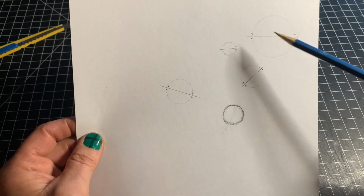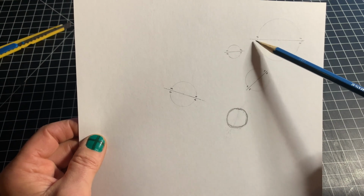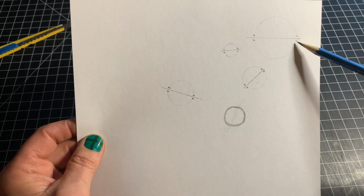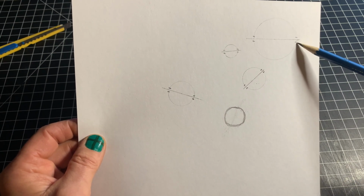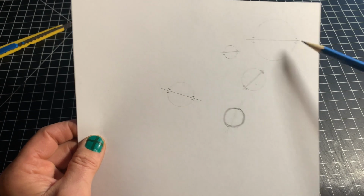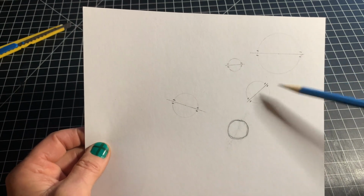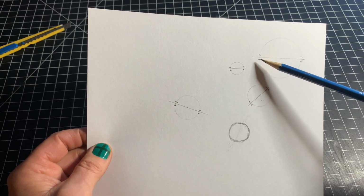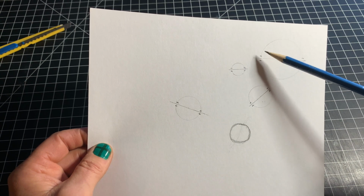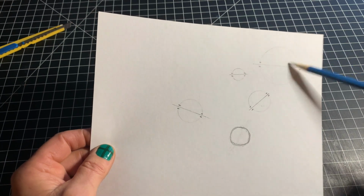Now, what happens here is, because we're not just cutting this thing full of holes, we're going to be curling these pieces, and so we're basically cutting 2 semicircles, and we're leaving a small amount. It can vary. I put a specific amount, but basically a little more on the larger ones, maybe 3/16 or whatever, not quite a 1/4 inch, and a little smaller on the smaller ones, on either side of that axis line. And that's to remind me to stop cutting. If I cut past that, then these things are going to be dangling out of there. So that's basically just to remind me to stop cutting.